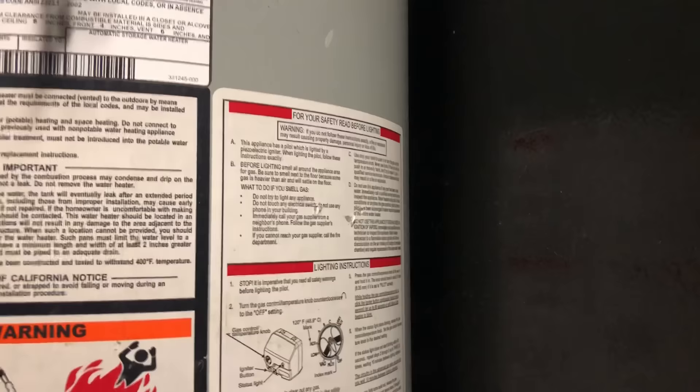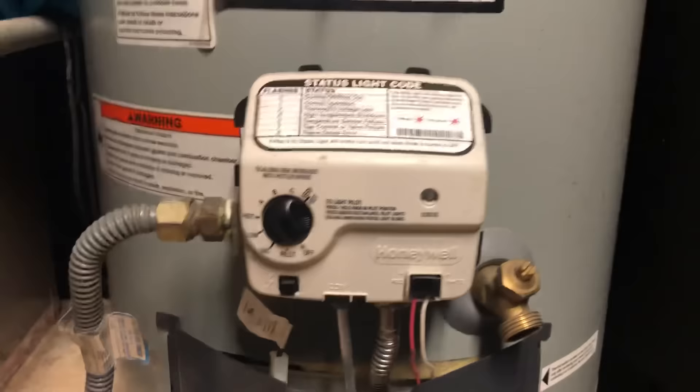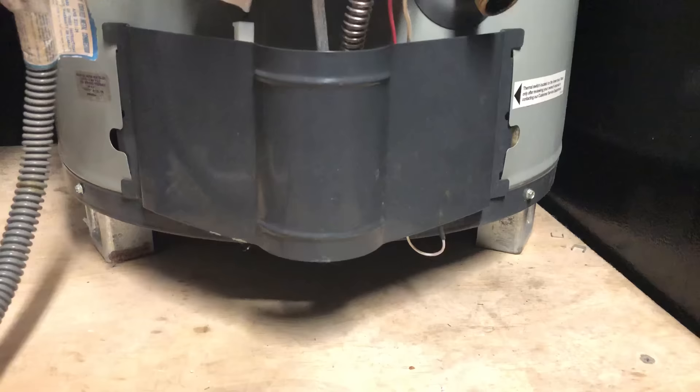It even tells you right here that there's circuitry inside this that is trying to stop you from rushing through that system. If you don't wait those ten minutes, it might not let you light the pilot because it doesn't like that you're not waiting the right amount of time — and that wait time is really for safety reasons. When you push this button you're sending gas down through the pilot. You do that for 90 seconds while trying to light it, and gas is building up. If it did not light, you've got unburnt gas down there that needs to dissipate before your next attempt — that's why it has you wait ten minutes.